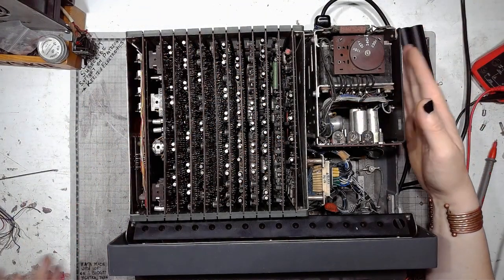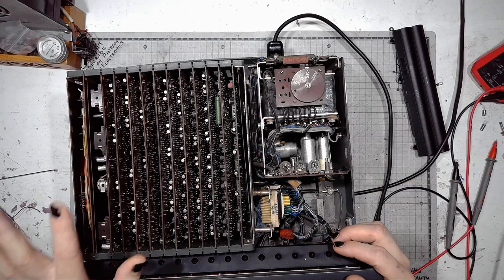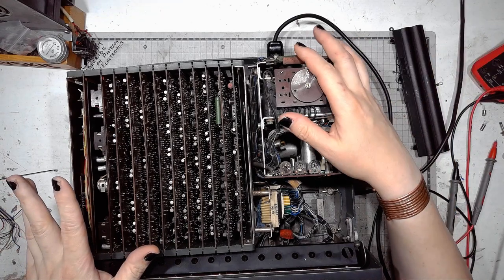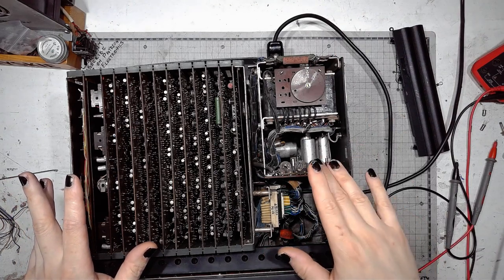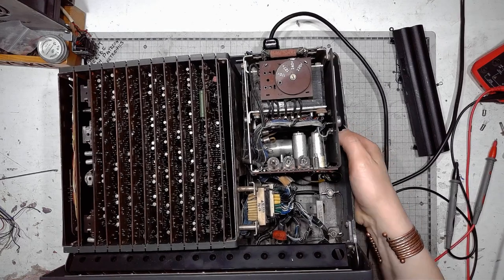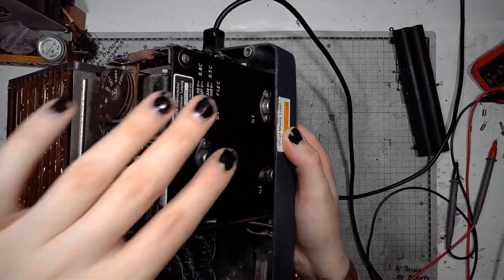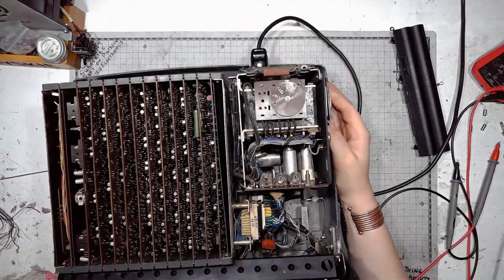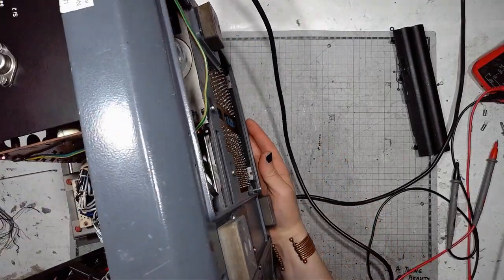Then there's also the power supply block. It's a classic power supply, none of that switching mode rubbish. It has a huge power transformer. It has a voltage regulator using pretty big electrolytic caps and silicon diodes. Has a heatsink on the side with the pass transistors. There's one more pass transistor on the bottom side of the calculator.